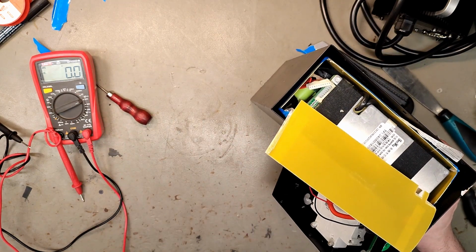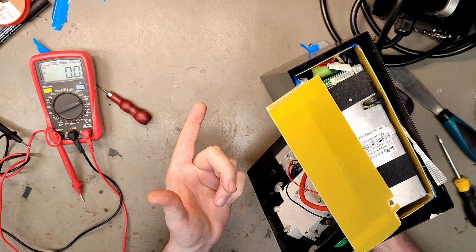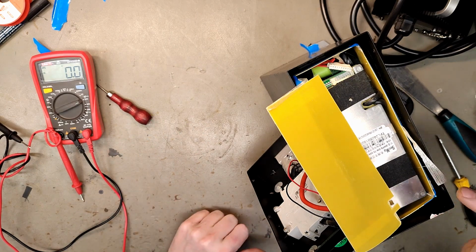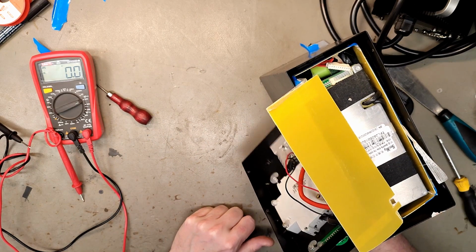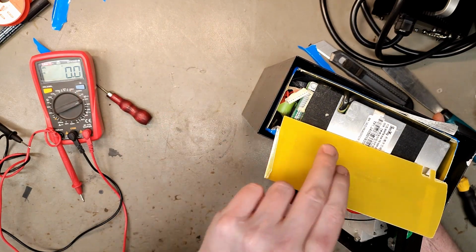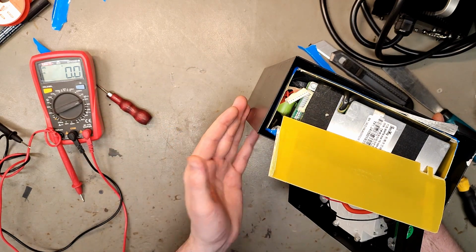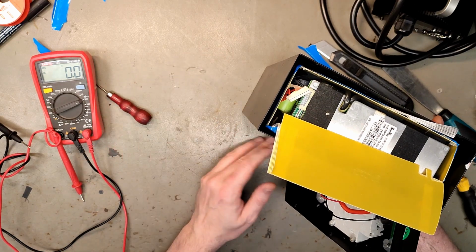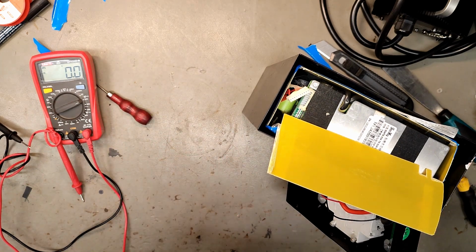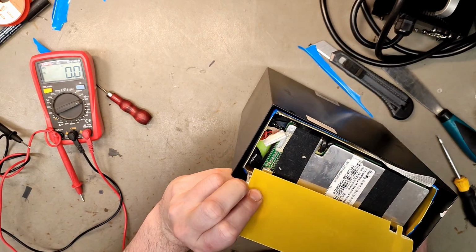Of course, we can balance the low cell, but one, there is a big risk. We should never ever try to balance up unless it's one single cell. So we would need to take the whole battery pack apart, test every one of these individual cells, and see if every one of them can handle voltage and want to increase the voltage, and then put it back together, and that would cost more than to build a new battery pack. And we don't even know what brand cells there are.